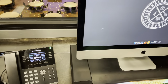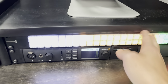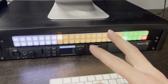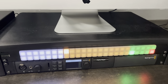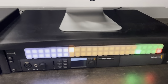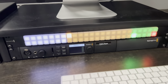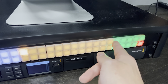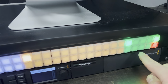Pro 6 is really limited, so we upgraded to Pro 7 and got this machine here which has five outputs. We have this alpha keyer which does our lower thirds, and it all comes together right there. This control surface down here talks to our video matrix. Think of the video matrix like the AV receiver you might have at home — except rather than HDMI it's SDI, and rather than one output it's 40 inputs and 40 outputs. Every projector, computer output, and camera input goes into the matrix and lets us route things.